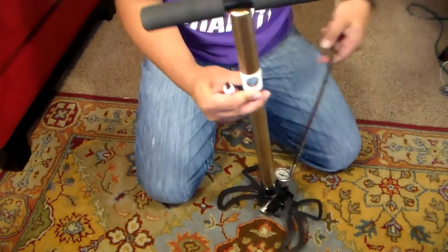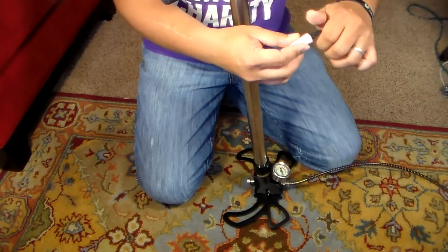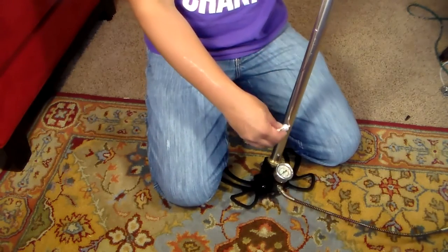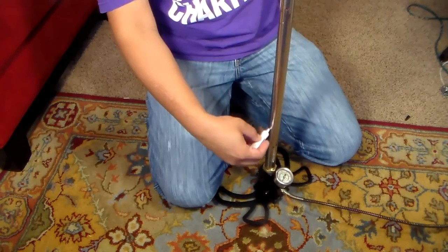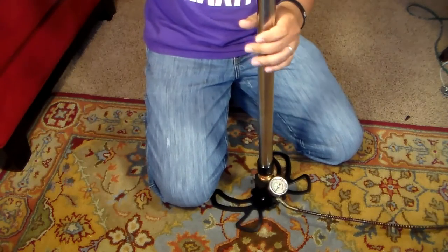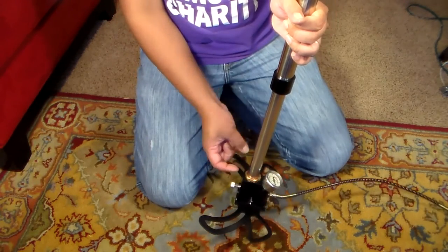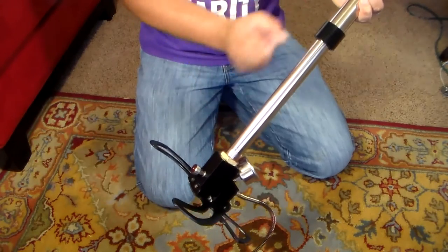And then, like I said, silicone oil. I'm gonna use Crosman pellet gun oil because I have some extra. I don't know if they have problems importing chemicals or liquids from another country. Just put it in there, it makes the operation of the pump run smoother. When you pump it the first time, you will notice a rubber O-ring that sometimes will go down or stay up here. That's not a big deal because it prevents metal to metal contact.